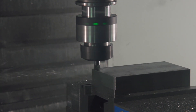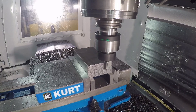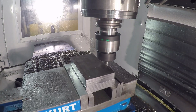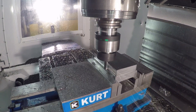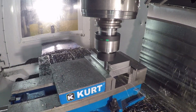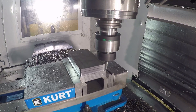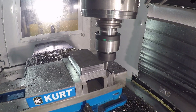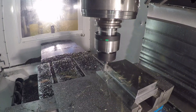I mentioned my little trick about making a full pass around the part. I say that because your first pass may be a little lighter or heavier based on the size of stock you've loaded in the machine. As a quick trick, it's always a good idea in CAM to define the stock a little large so that first pass errors on the side of being light if anything.